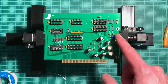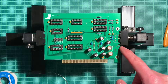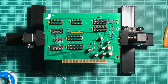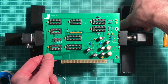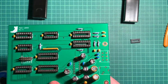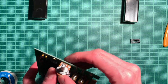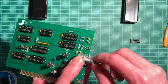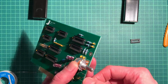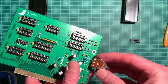The main problem here is the pot and the audio jack. By mistake I ordered the wrong audio jack, so next week I will get the proper one. I ordered the correct pot, but these are the pots that supposedly fit and they do, but they are huge. For whatever reason, probably because it was at hand, the designer of this card chose this footprint - it will fit but you won't be able to install it properly in your PC and the bracket won't fit at all. People on the forums said the smaller ones do fit if you bend the leads a little bit.